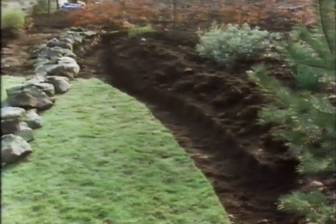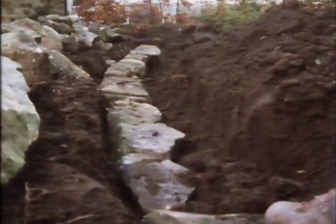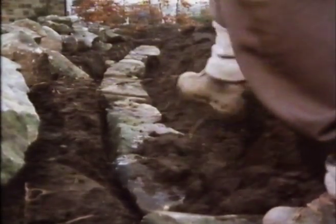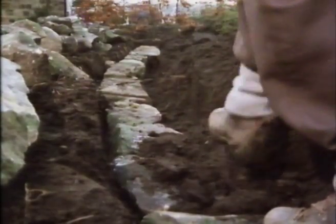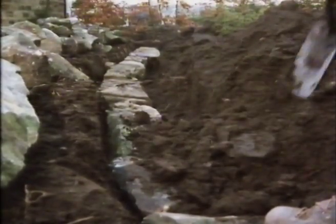Most important when you start to build a wall of any sort, make sure your footings are sound. And to provide a good firm base, I use the biggest stone. And then get your boot in and really ram it firm, because you're going to lay backers into that to tie the wall into the earth behind. And if the soil below them settles, the whole wall comes down.